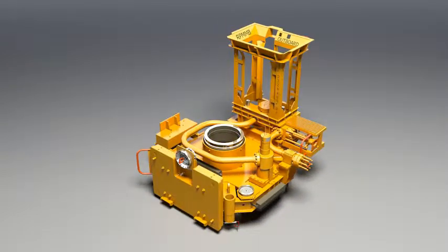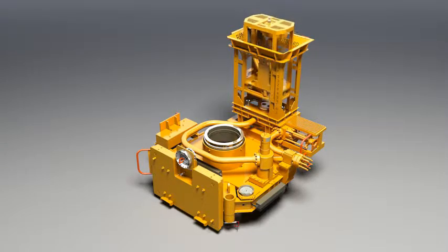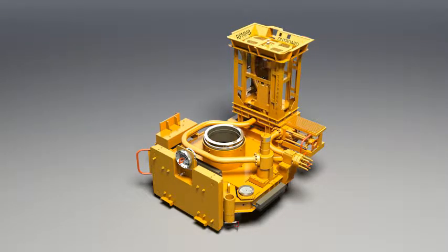On deck, the shipping caps are removed and the marine growth covers are put in place. Once the RPM hub cap is removed, the dummy RPM can be installed into the mounting base. The dummy RPM will be installed in the same way as the production RPM, using the MPRT. Once installed, the RPM clamp gaskets can be tested. These processes are detailed in the Mars equipment installation animation.